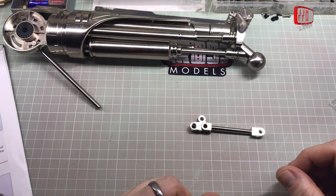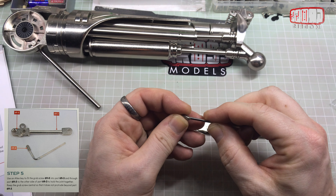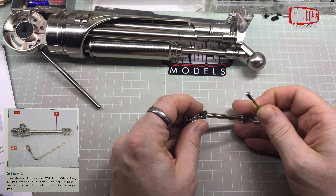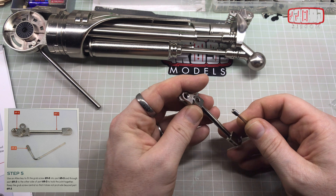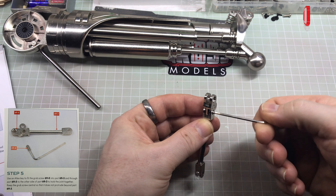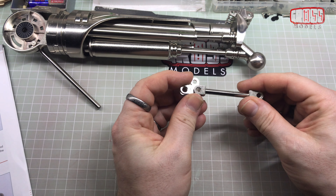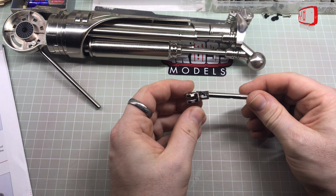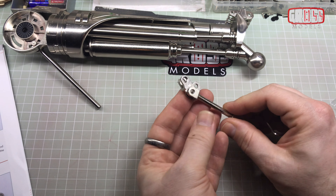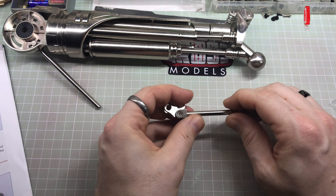We're taking that and one of these grub screws, and the Allen key that they supplied us many weeks ago which is the correct size. There is a thread on one side of that, so it's threading through into there. Fitted that through there, the other side holds it together — keep it central so it doesn't protrude. Tighten it down until it comes flush: put your finger on the other side, tighten until you feel it touch, and it will not be sticking out either side. So that's that.